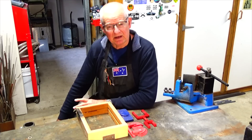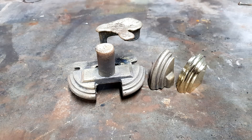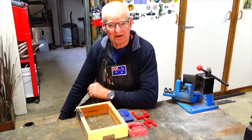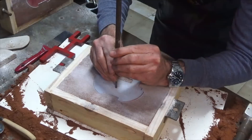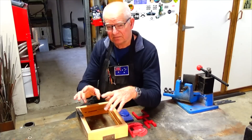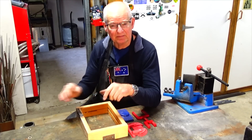In order to make those light fittings I needed to be able to make four decorative brass castings, and when I made the video on the castings I mentioned that I had a lot of problems with my hands. I've got very shaky hands, and when you go to lift the pattern out of the molding flask if you don't lift it steadily it will knock from side to side and it can damage the cavity that you're going to pour the liquid metal into.